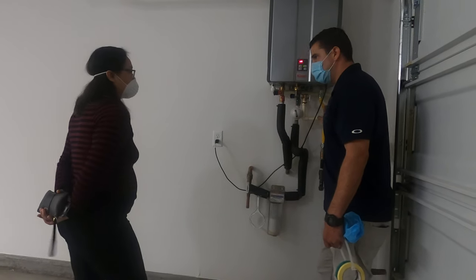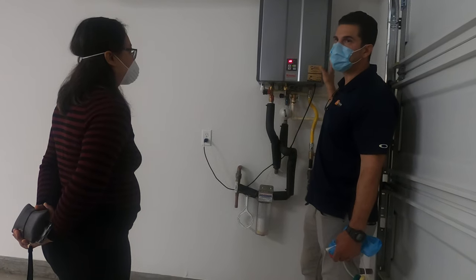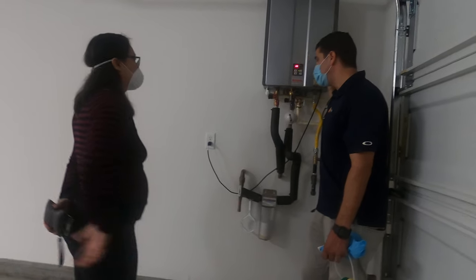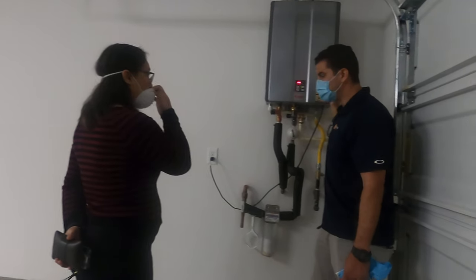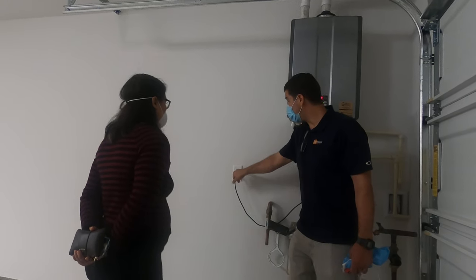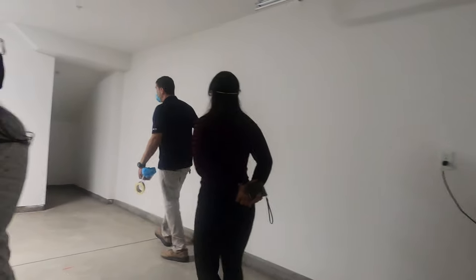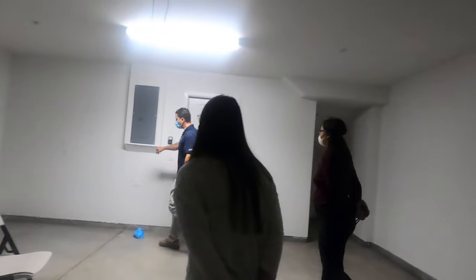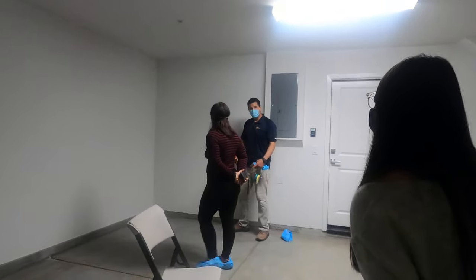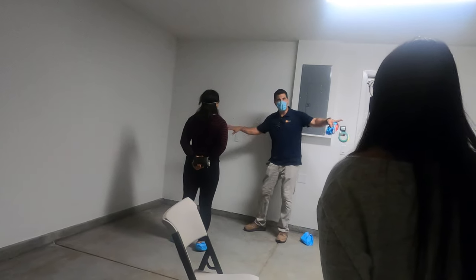You don't have to shut the gas to work on the cartridge. Keep in mind the tankless water heater needs electricity to make hot water — no electricity, no hot water. If you lose hot water, the first thing to look for is the GFI outlet. This unit is plugged into an outlet that is downstream from a reset outlet, the same type you have in your kitchen and bathrooms.